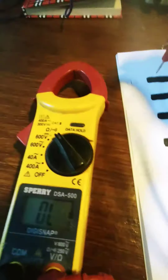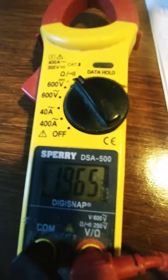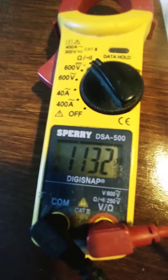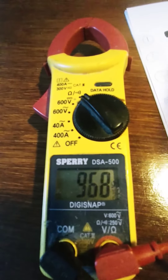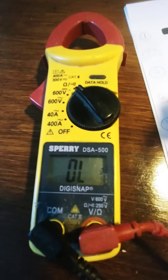I just painted five strips, just one coating each. We're just gonna get the resistance, so we put the leads across here. This one here we got 19.66 ohms, next one we got 1.32 ohms, and the third one we have 964 ohms.